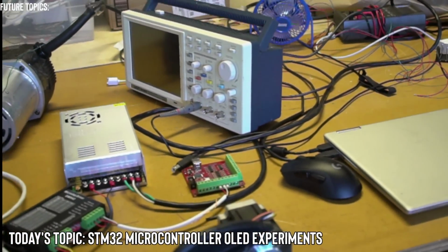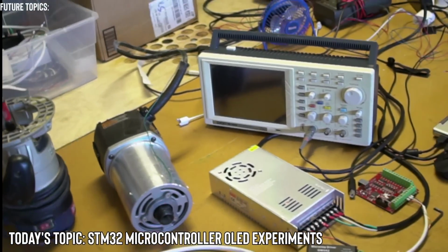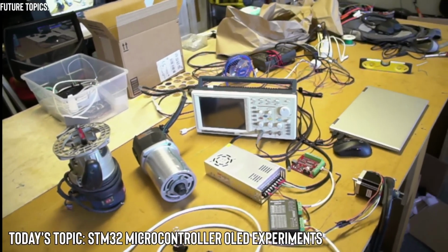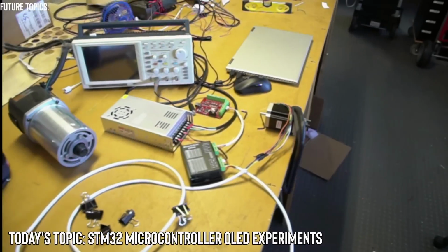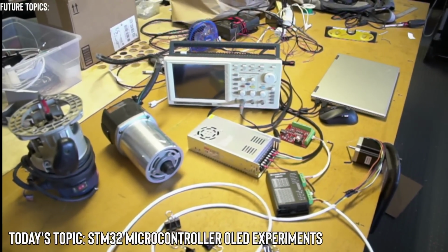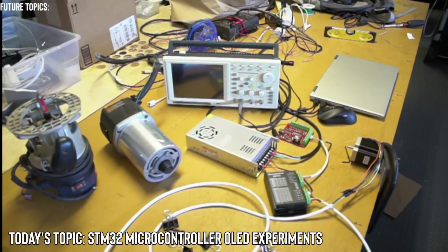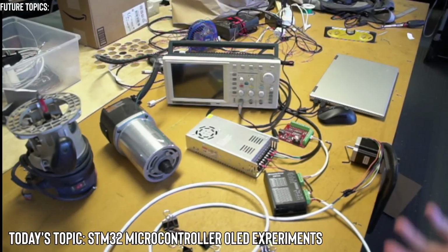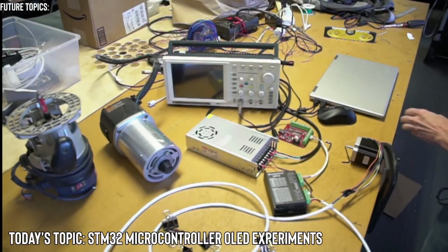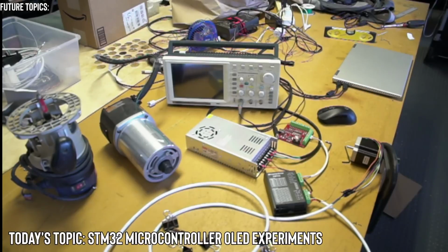Okay, so the last thing we did on Tuesday, we were looking at an antenna type of situation where a single conductor would be just open-ended, floating. They call that a tri-state actually in microcontrollers, and it generally acts like just an antenna. It's going to receive pretty much everything, all of the EMI that happens everywhere, and we've found that. So that's actually kind of a good thing, so we can learn how to get away from it.